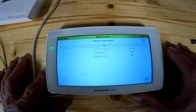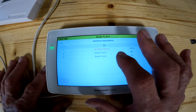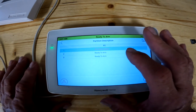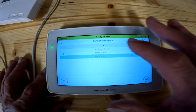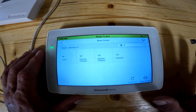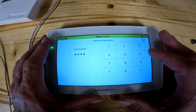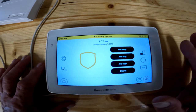As you can see, partition one is not ready because the panel isn't hooked up to anything. Partition two and three are there and ready to arm — they're not programmed either, so you could arm them if you wanted to. You can click on individual partitions. If your warehouse on partition two wouldn't arm, you'd hit that partition, click okay, and it takes you into it. Once you're in that partition, you could hit the three dots, show zones, and it would show you what zones were open. For most of you, you don't have to mess with this at all — it's more for business or commercial application than residential.